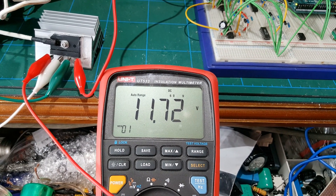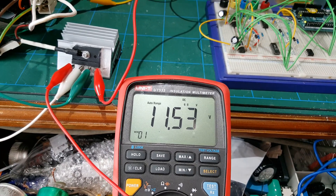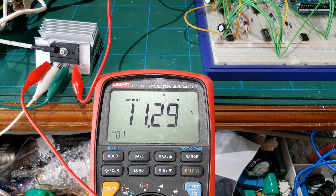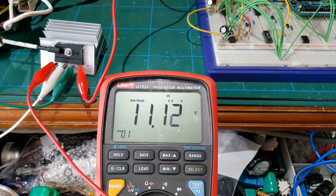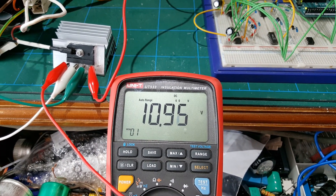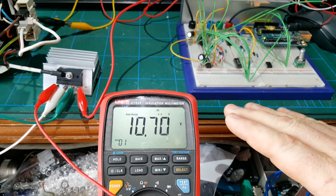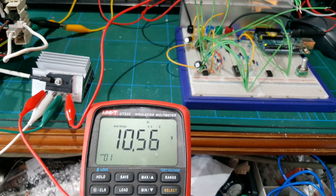The main battery bank wouldn't be able to capture all that energy — some would be wasted as a resistive load. The idea is that the buck-boost converter would discharge at a higher rate than you'd ever need to generate into the capacitor bank. So if you had a really low power DC-to-DC buck-boost converter, it wouldn't be able to transfer the power from the caps to the battery quickly enough, and you'd end up charging your caps and losing your braking ability. So you need to size everything proportionally.